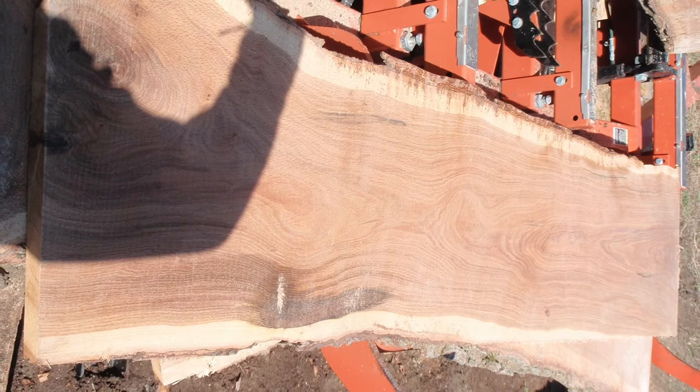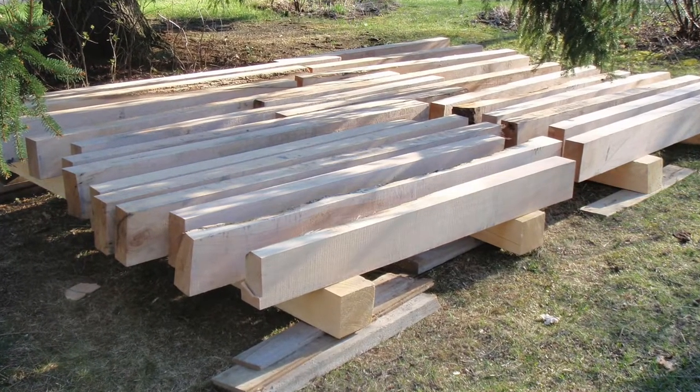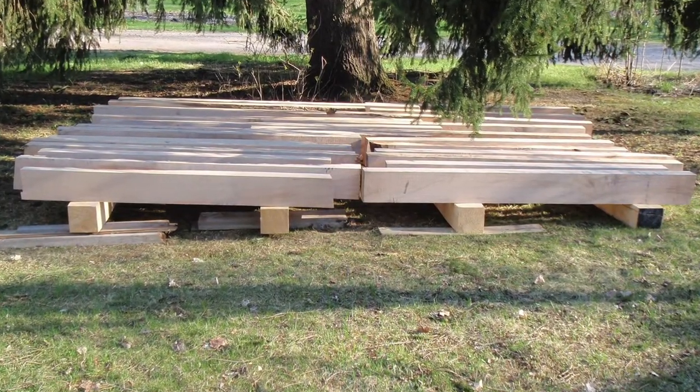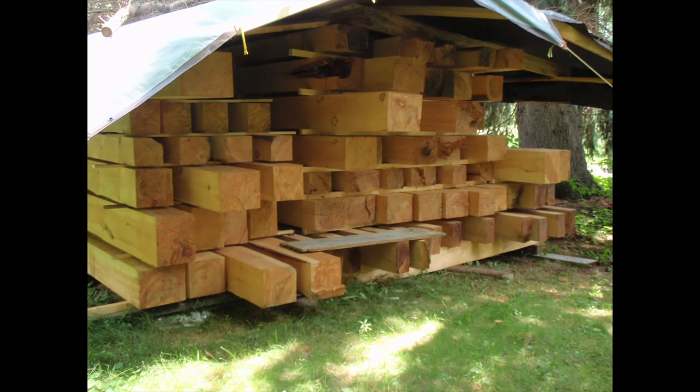In the end the milling process took about two and a half to three weeks with a couple of rain days in there. Once we were all done I took a little break and then started hauling the timbers home. I ended up using the brace stock as a really stable, strong base for the pile. It's really important that you make your pile really flat and really level, otherwise you risk seasoning a twist or a bend into the timbers over time. There's one of the two main piles of timbers for this project. For spring, summer, and fall I just lightly covered it to keep the rain off, allowing free-flowing air from all sides to dry off the surface moisture and help prevent any mold or mildew. For winter, to keep snow from blowing through it, I wrapped it all up in a heavier-duty tarp, and there it stood until just a couple of weeks ago when I started to unwrap them and record this footage.